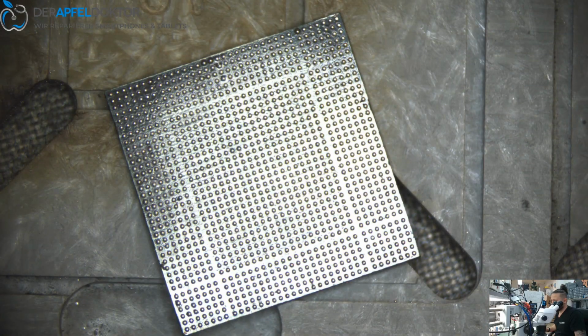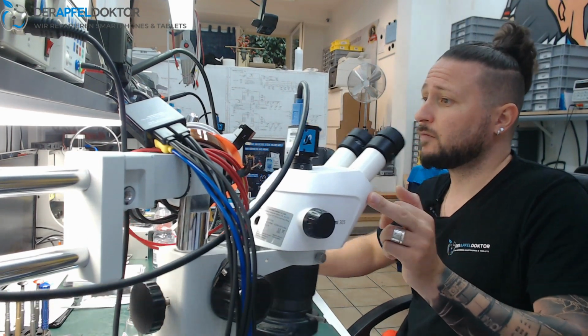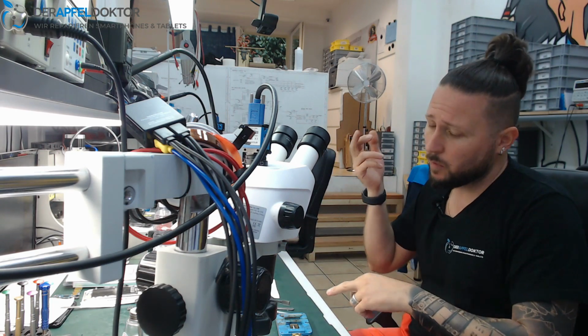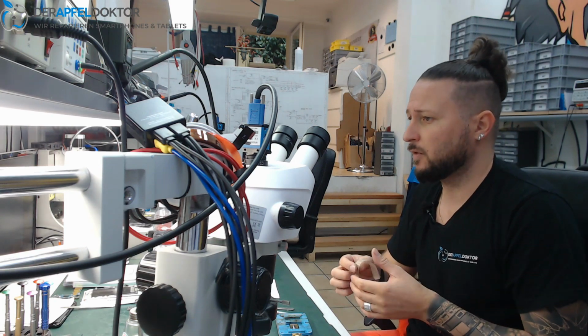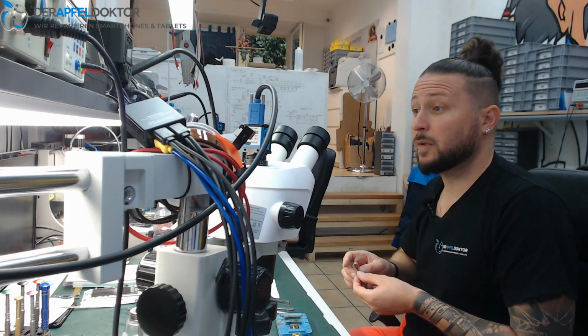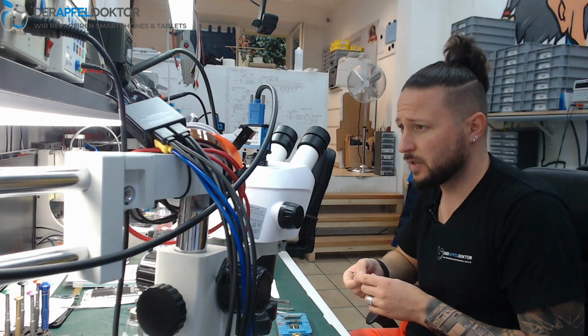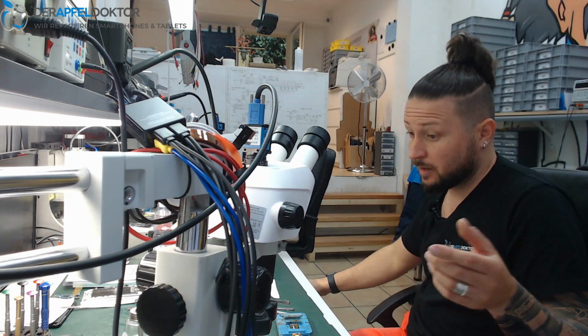Okay, I hope you enjoyed the video. You saw how much time it can take, because it was about 45 minutes, and that's really a lot of time for that. Normally I say when you separate the RAM, reball the RAM side of the CPU and reball the CPU, about 25 minutes should be your time. Okay, but today just a little bit longer. Normally 1 to 2 takes for reballing the RAM side of the CPU and 1 take for reballing the CPU side. After that, just reball the RAM.